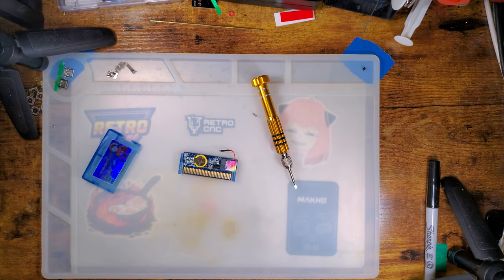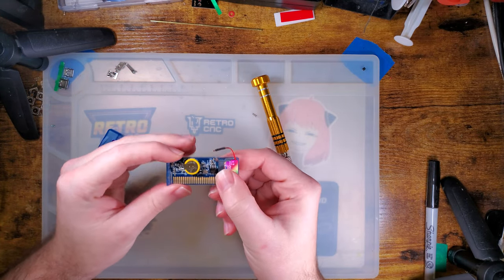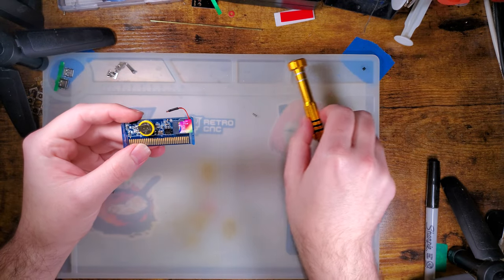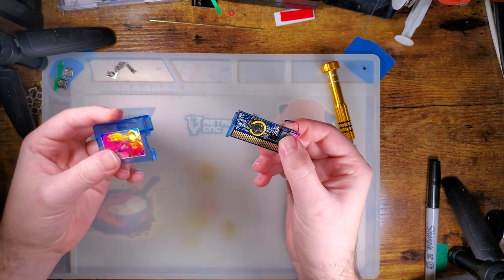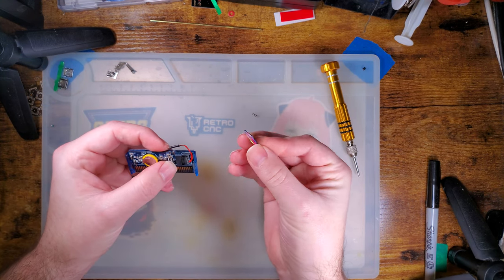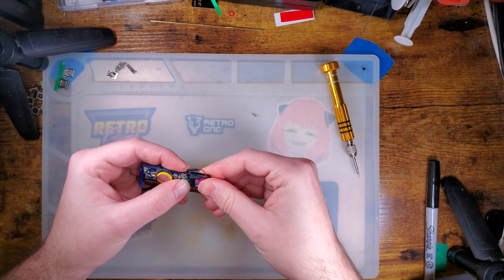On the original Easy Flash Omega, you don't really need the battery for anything except the real-time clock. The cart still works totally fine. When you save in-game, it just writes directly to the SD card — that was the exact reason I added the indicator LED, so you can see when it's accessing the SD card. Don't turn it off when you see the indicator LED blinking. I've had exactly zero issues with mine, though some people seem to have non-stop issues. Could be related to your SD card or your game.